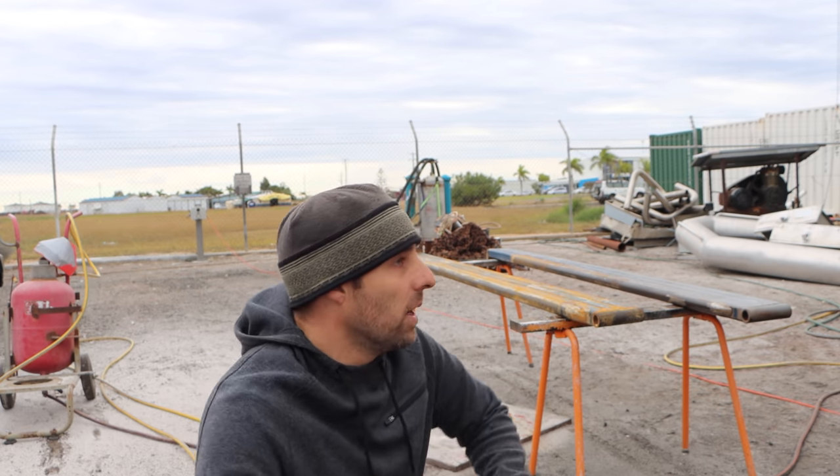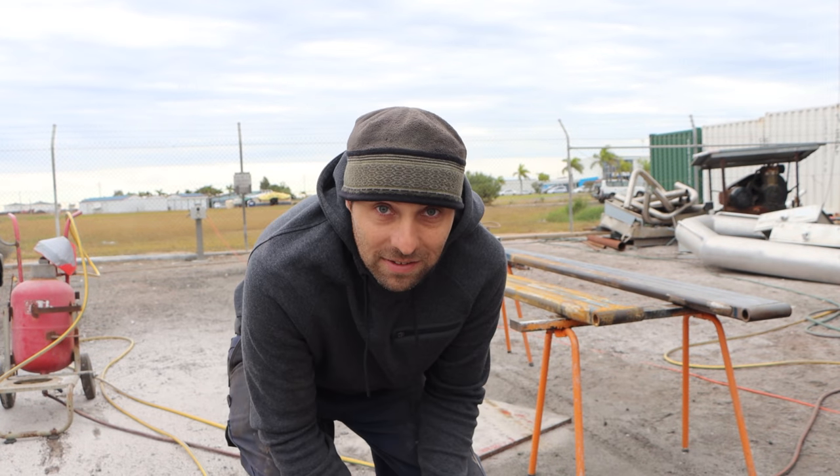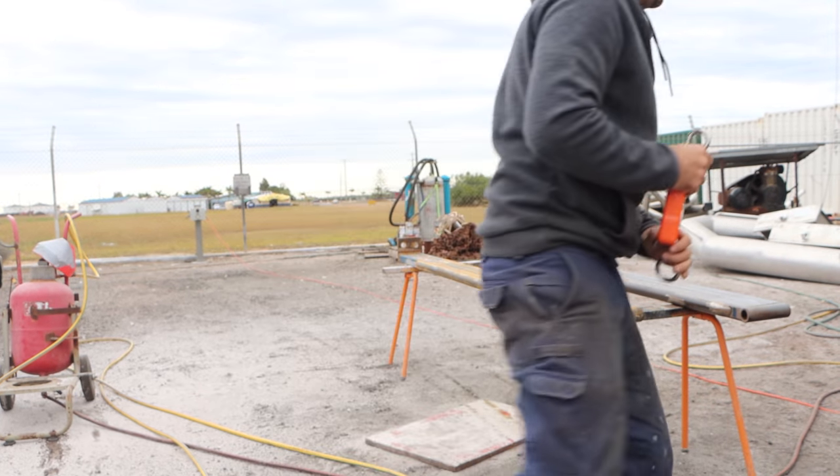The winches can lift 5,000 pounds, so I think that's about 2.5 ton or 2,500 kgs roughly. Someone will surely correct me on that one, but with 300 kgs and winches that can lift a couple of ton each, we're going to be fine. And that's at a single purchase as well. If we want to do a double purchase, a 2-to-1 purchase, we can lift twice as much at half the speed, so we've got plenty of scope on those winches. So we'll get to measuring the full wing and see what we're working with.